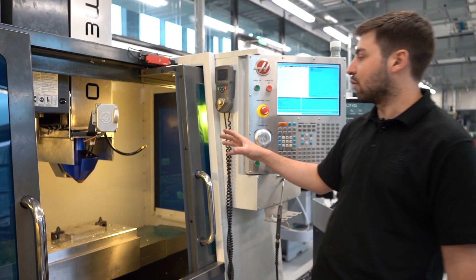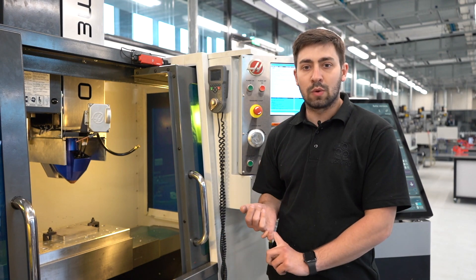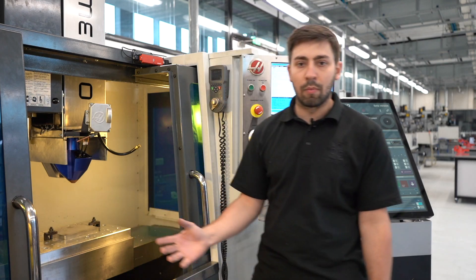With this we've got a six laser configuration, 1.2 kilowatt maximum heat. We can run with any different kind of metal wire, and we can do dual wire feeds — depositing onto the substrate and machining back, all in one process.